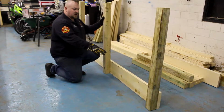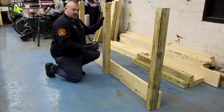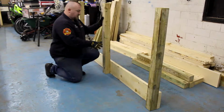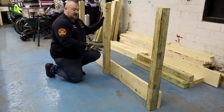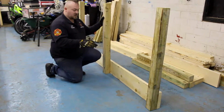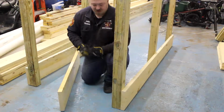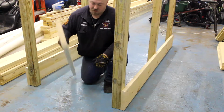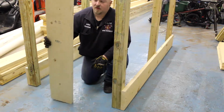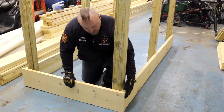this side. Right, then once you secure both ends, measure out your middle, and I put 4 screws in each one of the boards, and then put your middle in. And once you do that one, you can stick this out of the way. Do the exact same thing with the other 2x10 by 8 with 3 more to make it exactly like this one. All right, once you have both sets done, you're going to take your 2x10, the 4-foot, and what you're going to do is just attach them to the sides right here.